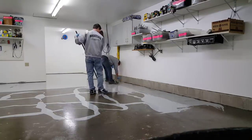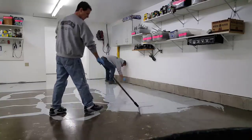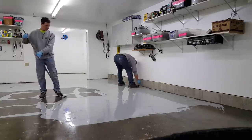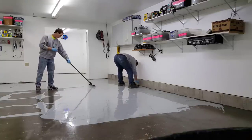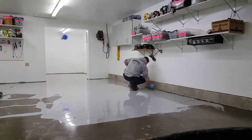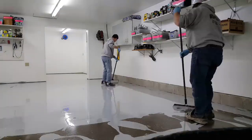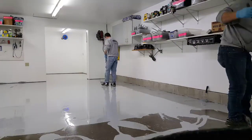The course down in the description will teach you all of this — from concrete floor prep to fixing cracks, to the primer coat, to the 100% solids coat like we're doing here, and then the top coat we're putting on to protect the epoxy. It's basically three coatings, and this is going to last you for years and years. This stuff is not going to peel off or bubble off if you do it right, and as long as your floor doesn't have a ton of moisture under it, this is what you're going to get.